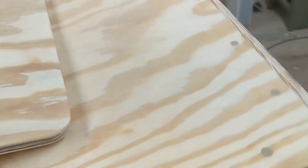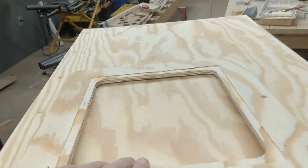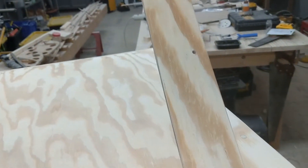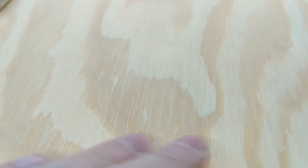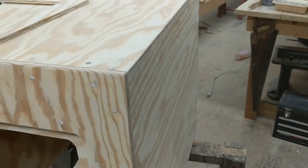The back is solid. Here's the door — I had to fill some imperfections in the plywood. You can see where I took a router and cut an area out for the glass to go in, and there's the hole for the knob. I've sanded the plywood all the way down to 120. Just the nature of plywood — you can see there are some imperfections, and even where it's not obviously noticeable, the surface still isn't smooth; there are little valleys. And it's got to be painted with semi-gloss black, so I want it to be as smooth as possible.